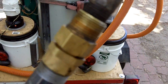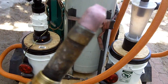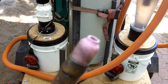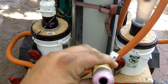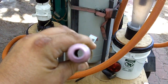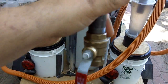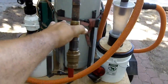This part screws into the bottom orifice, and this part that looks a little toasty actually sticks up into the propane tank. This pink tip is a TIG welding cup — made out of ceramic, it can withstand several thousand degrees Fahrenheit. This is a five-sixteenth TIG cup. What hangs off the bottom of the propane tank is a one-inch mild steel pipe with a ball valve — you want that open — and it basically screws in the bottom.